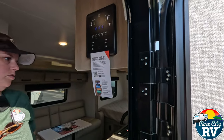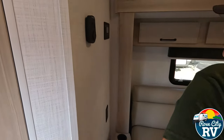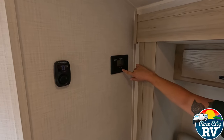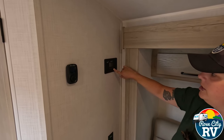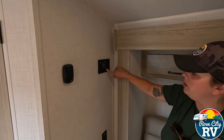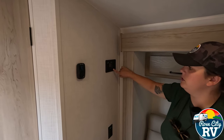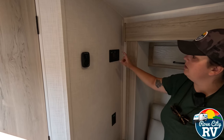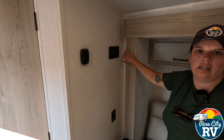We also have our solar controller over here. We don't have a battery hooked up so it's giving us a slightly off reading right now, but this controls the voltage going to the battery. This unit is equipped with solar — the controller converts that down to the 12 volts needed to keep your battery charged. Solar can come in around 20 volts, and without a controller, that would fry your battery. When everything's hooked up, this will also give you voltage and amperage readings so you know exactly what's happening.